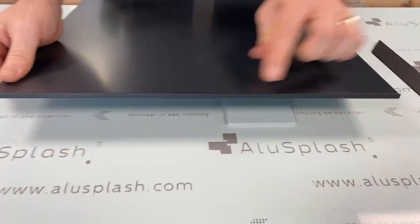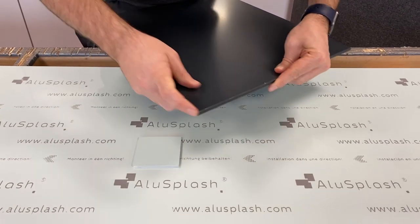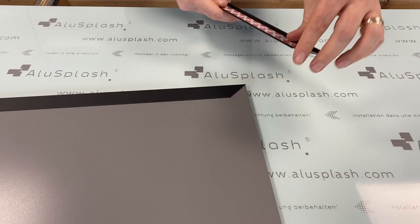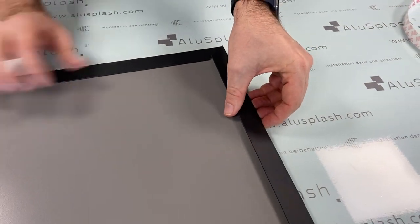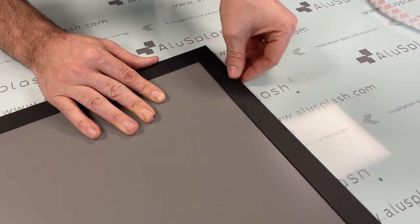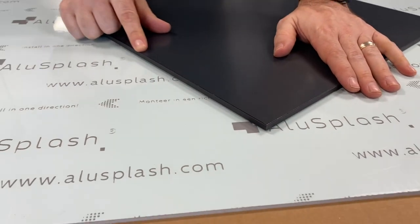Now I know that piece is stuck exactly where I need it, sitting perfectly and minimalistic. I've got to come along and do this edge — same process, ensuring that my 45 is good. I always hold it up at an angle just to make sure I can move the trim up and down and push it into position. And like so, now we have a nice detail of the finished panel.